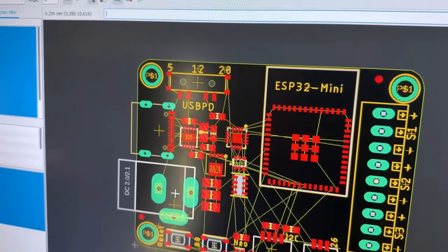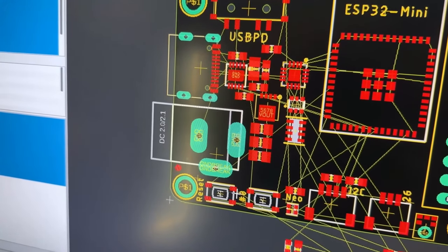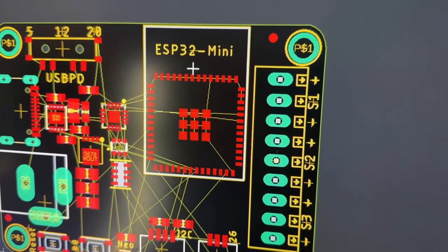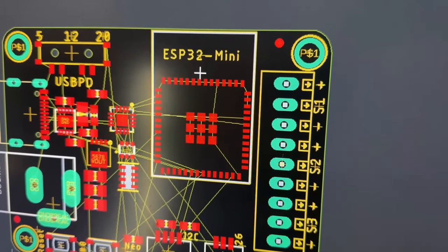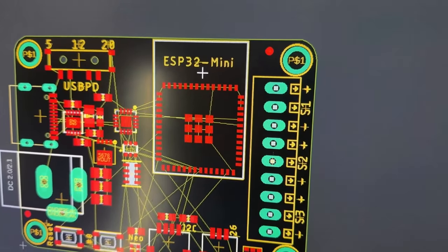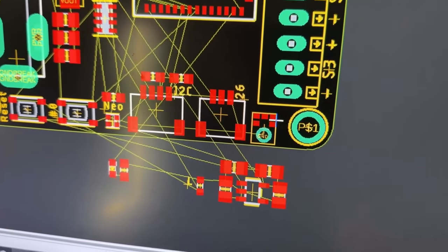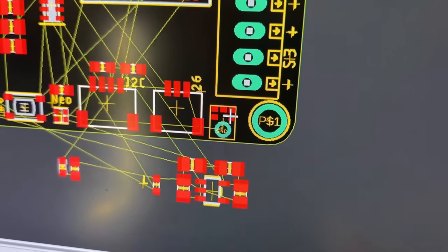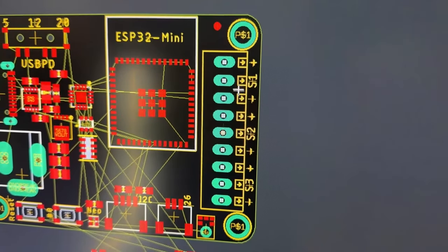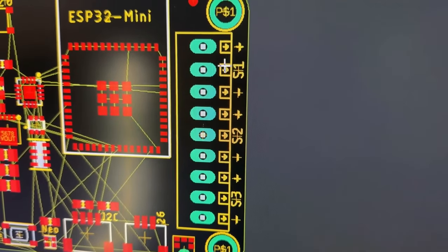You could also use a 2.1mm DC jack if you want an outlet or a AA battery pack, plus reset and input buttons. There's an ESP32 with a USB serial converter. WLED supports the C3 and C6, but I found the ESP32 Classic is the best supported. There's I2C for adding OLEDs or sensors, an analog or digital input, and I'm thinking about adding an I2S microphone right on board so you can do audio reactivity. There's a nine-pin terminal block covering three signals.